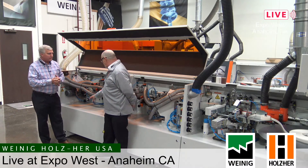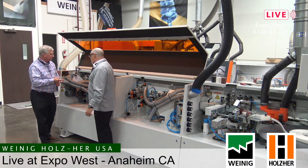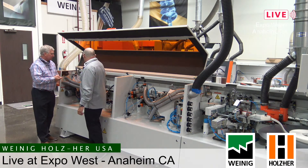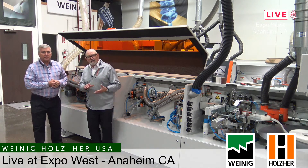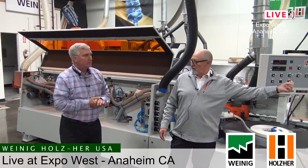Then we have a single-motor corner rounder — again, an on/off switch. Scrapers: a profile scraper, pneumatic buffers, and a flat scraper for the glue line. Because it is a two-position machine, companies will build a cheat sheet — take a picture of it — that shows when you run thin tape, these are where the switches go; when you run two-mil, this is where the switches go. In southern California our workforce is pretty transient, so a visual cheat sheet means any operator can run the machine correctly without prior knowledge.